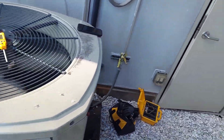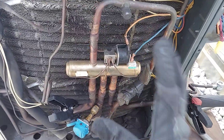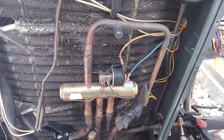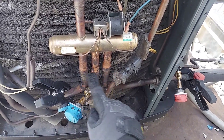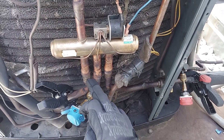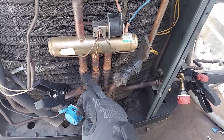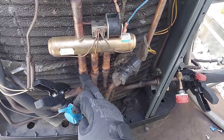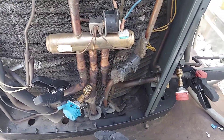Alright, so let's talk about the tricks — the moment you've been waiting for. My method of replacing this 4-way valve. I know that even pros, this gives them a hard time, because you are trying to remove these three pipes which are side by side, and it's difficult. If you're going to try to use a torch it's hard to unsweat, or unbraze, or unsolder all three pipes simultaneously to get this thing removed.